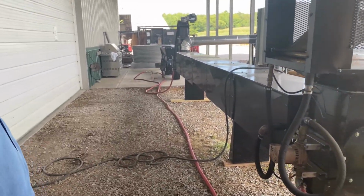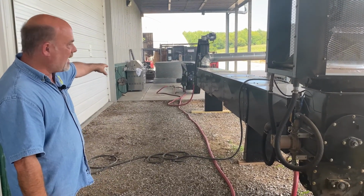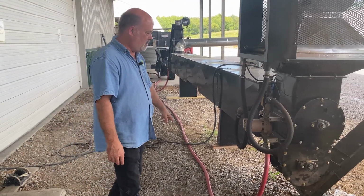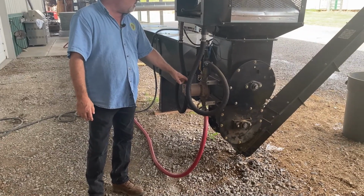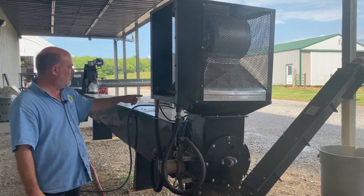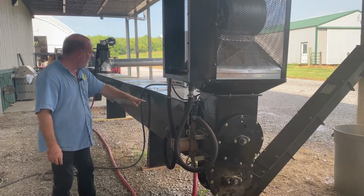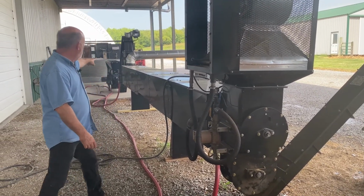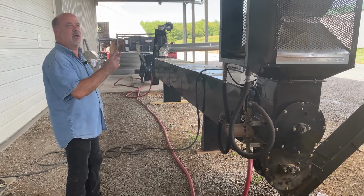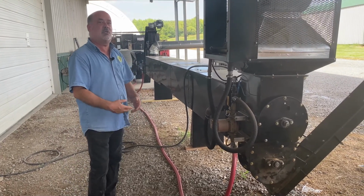But at the moment, because I'm not heating a building, it's still summertime, I've tapped into the hot water source here on that slab. So the hot water is being pulled into this unit, pumped through the heat exchanger, and then when we pull off 10, 20 degrees here, what's left goes into the hot water and then back down to where my burner is reheating the water, and it just stays in that loop. So as long as there's hot water, the way we've set this up, it will just continue.